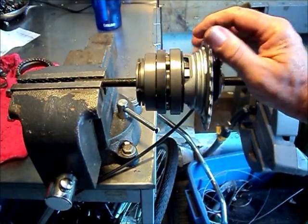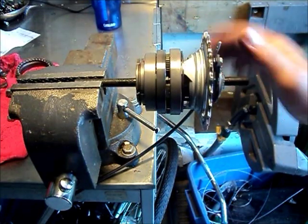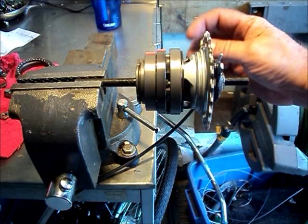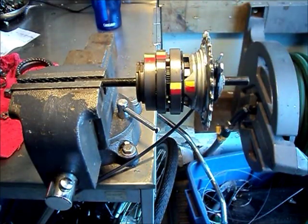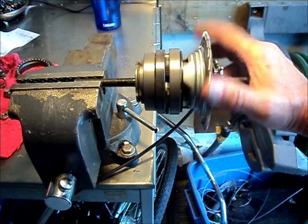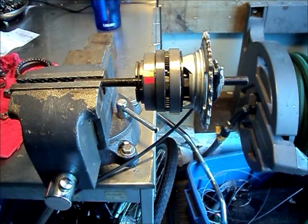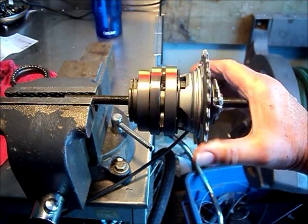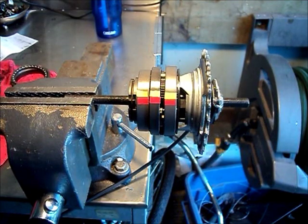Now with the entire unit assembled: in first gear, with all sun gears disengaged from the axle, all stages rotate together — a drive ratio of one rotation input to one rotation output. In second gear we engage the second stage sun gear to the axle, so second stage overdrives the third stage at a ratio of one to one point three. In third gear the third stage sun gear is engaged to the axle, overdriving the final output at a ratio of one to one point four eight. In fourth gear the first stage is engaged to the axle — the three marks on the left stay in alignment and all outrun the driver. Final drive output one to one point six nine.